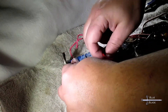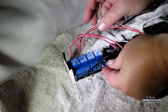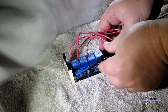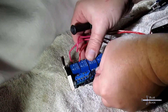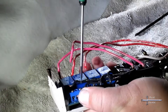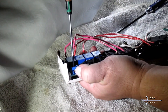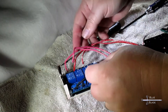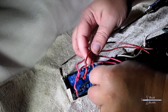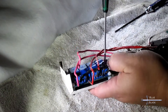Now I connect the power lines to the relays. The black wires are the power feed — they connect to the center screw of each relay. The red wires connect to the outlets. I connect them to the normally open terminal for each relay — that's to the left of each power feed wire in this view. Connected in this way, the outlets will be off unless I turn them on with the controller.